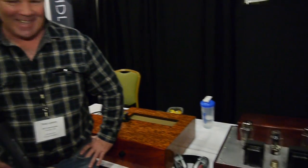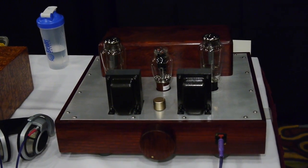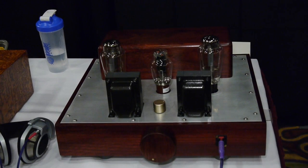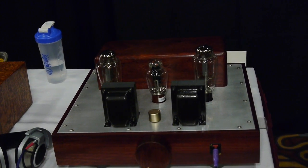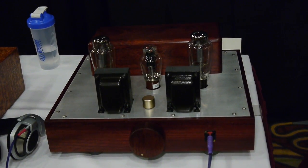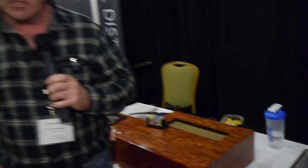Hi, I'm Jude and I'm here with Tony Landry from Exit Level Audio. He's new to the business, and he's here starting with a bang at CanJam at Rocky Mountain Audio Fest 2012. Tony, this thing's a beast — starting with that volume control. Can you tell us what this headphone amp is? It's based on an Emission Labs 20B tube. I use that because it allowed me to not use a driver tube, so I can pretty much control the sound just using an input transformer. It's transformer-coupled input and output, the topology is extremely simple, and all the amps will be custom made.